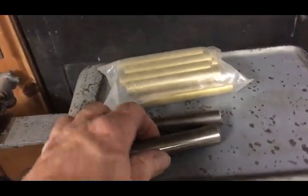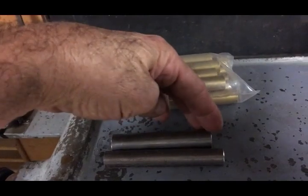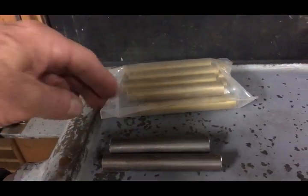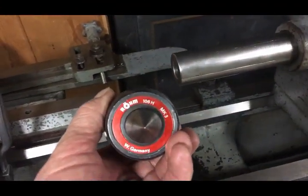And this is part of the job that I needed the taper attachment for. What they are is tapered plugs for plugging off cooler lines on our compressors when they get a leak. It just plugs them off and pretty much eliminates it.